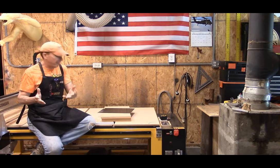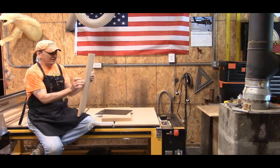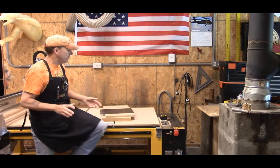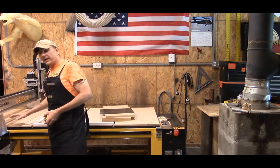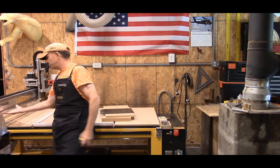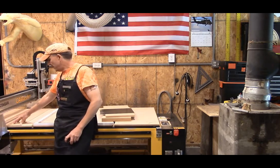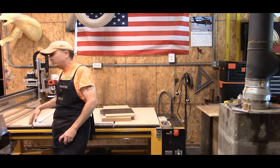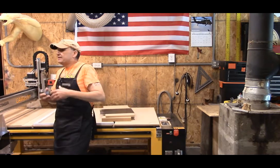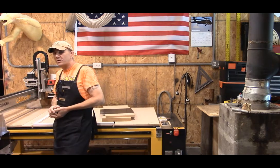I'm going to rip these pieces down. I have a top and a bottom, and this will be my sides and my ends. We're going to keep it shallow — an inch and a half to two inch rips. One important thing to specify: please take a tape measure, go to an untouched section of your spoiler board — do not go where you've already planed it down — and measure from there to the underside of your gantry. I have five and a quarter inches off my new spoiler board section right here at the end of the machine. My finished vacuum box will probably be 10 by 12, or 10 by 16.